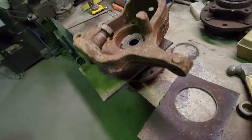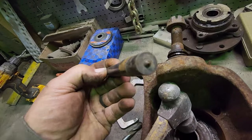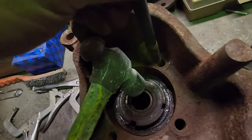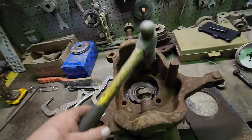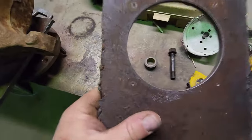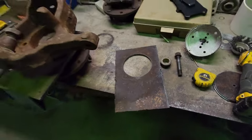So this is how I'm doing that — line that all up where I want it, put that centering punch in there. Didn't have the right size metric one, so I just put a little tape on it so it's in there nice and tight. And then whack — do all those and then you end up with your marks on the plate like that. I'll just drill them.